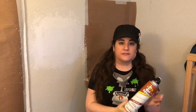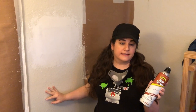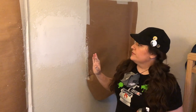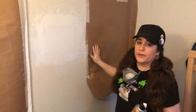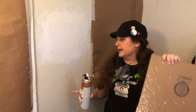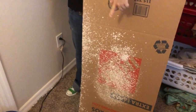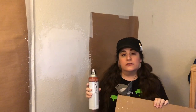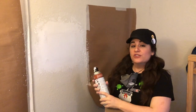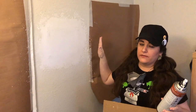The patch has been smoothed, skimmed, wet sanded again, and now it's as smooth as we can get it — time for texture. These are just spray cans of texture from the hardware store. First look at your walls and determine if it's orange peel or knockdown. The walls today have a very light knockdown, so that's what we got. This does get messy, so we put up paper on either side and have a large piece of cardboard to hold underneath as we spray. Practice with this on the cardboard first — if you do mess up it wipes off with a wet cloth. Work in a circular motion and work your way outward to blend the edges.